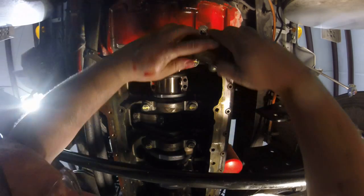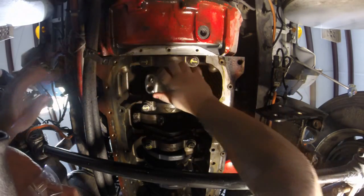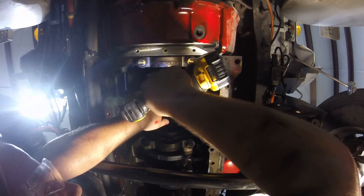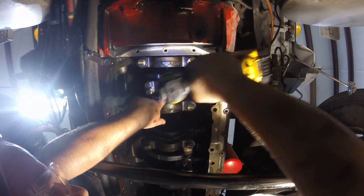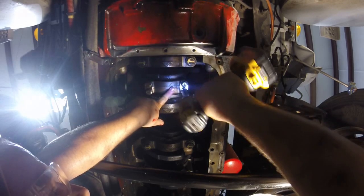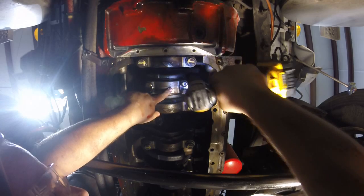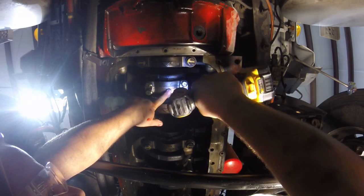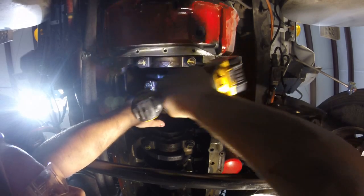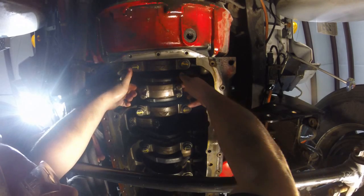So on this rod cap, we're going to make sure — see where it sticks out on the bottom, easy to go towards the front of the engine. Insert bolts. Bring up each side — an X pattern seems to work best, criss-crossing. See how we got it a little farther this time. Run your fingernails along the edge, make sure you don't have a gap.